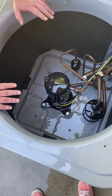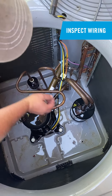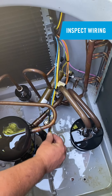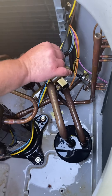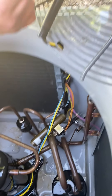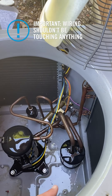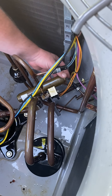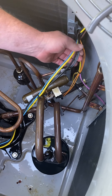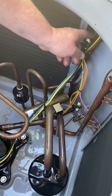Next, inspect the components inside. Look at the wiring — make sure it's not touching anything, not frayed, and that all supports are intact. Make sure the wire is clearing the fan motor assembly and not touching any pipes, because these pipes can get hot. Check the connectors; if you have a reversing valve, make sure that connection is good. Just look everything over to make sure it's as secure as it could be.